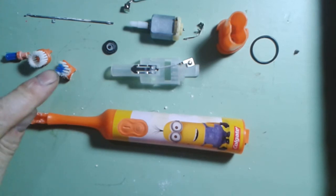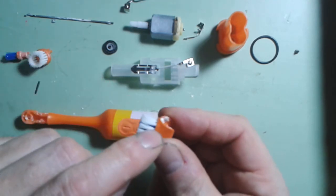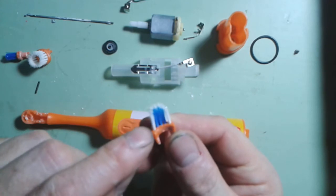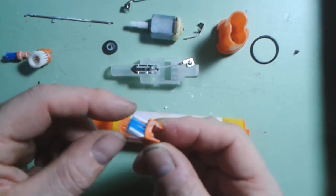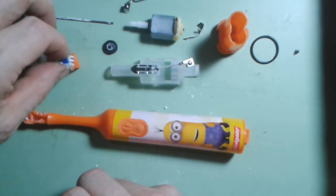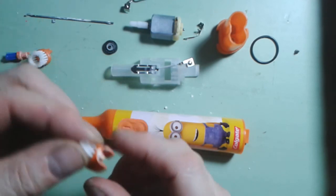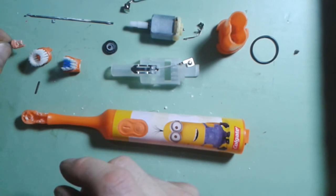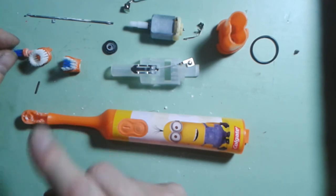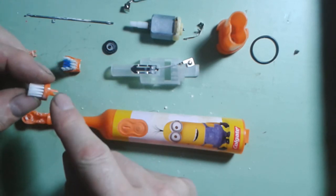The brushes themselves are probably almost nylon, injection moulded into these pieces of plastic and buried for life in there. Reprocessing and recycling little bits of plastic like that is virtually impossible currently because we can't separate those two pieces of plastic. Nylon probably wouldn't work for the base anyway — it's not strong enough, not always waterproof enough (it slightly absorbs water), and wouldn't take the shock of the oscillating movement that these fine pins experience.